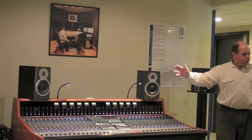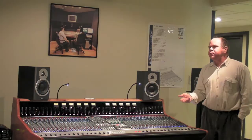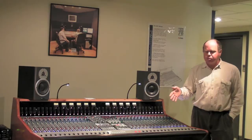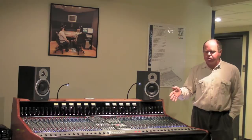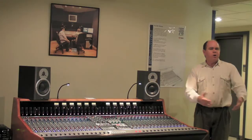This console, depending on the size and options, you're talking around $50,000. If you've got a $50,000 console, you don't want a $50,000 automation package. The plan is to implement automation using the DAW to store the automation data — probably something like MIDI control, though it can't be standard MIDI because that only gives you seven bits. You need at least 10-bit resolution. We're working through that, but the automation package will be retrofittable for consoles purchased before it's ready to sell.